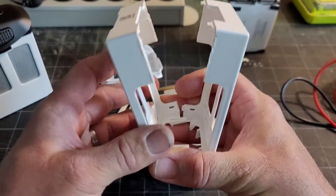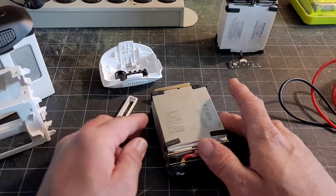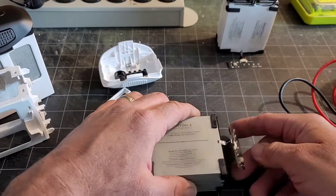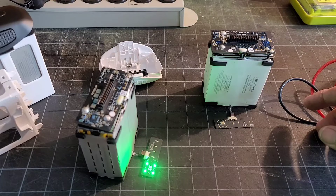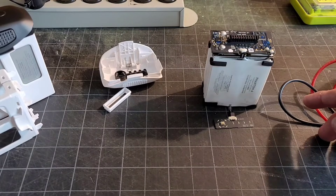Other possibilities: you could open the battery but leave the top on, and just clamp them apart a little bit enough to get in there to reach the contacts — kind of your decision if you want to work with the battery. Just use caution when you try it and reset the battery. I have played a little bit with the battery; I haven't flown it yet, but it's still holding the charge from a couple weeks ago when I charged it. Hopefully that helps some of you folks figure this out. Thanks for joining me — I hope this gave you some insight about the DJI Phantom 4 batteries, what's inside, and how to reset your battery to help you get some more use out of it. We'll see you next time.